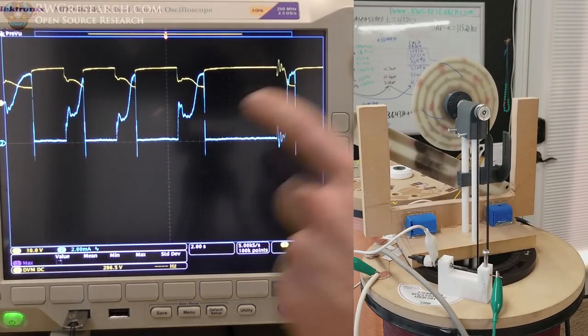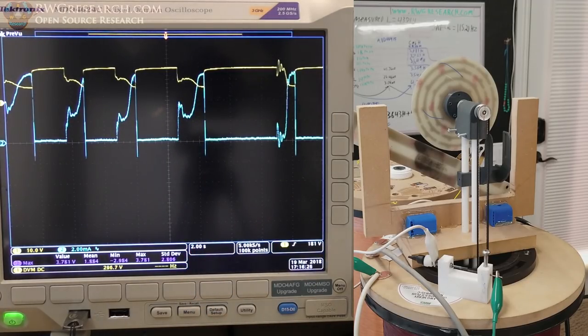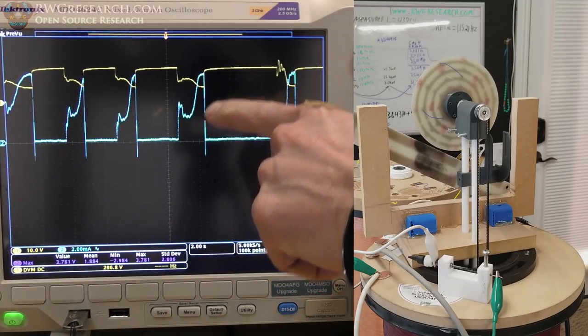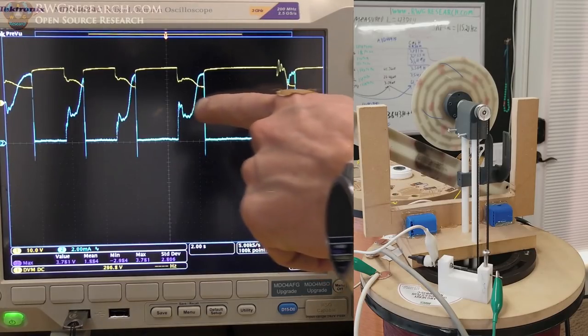Alright, so you can see the difference here. Here's where I was holding it back. It definitely used about a milliamp of current. Actually, it's on 2 milliamps now. So about 2 milliamps of current when I was trying to hold it back. But when it's completely flipped, where there's no more induction, you can see it goes back up to its full current. So in this case, it's 6.25 or so milliamps. But over here, you can see when I let it go, it completely canceled it. Alright?